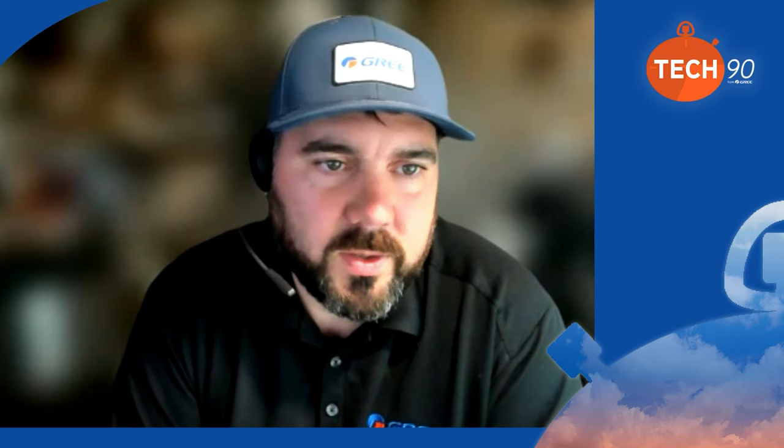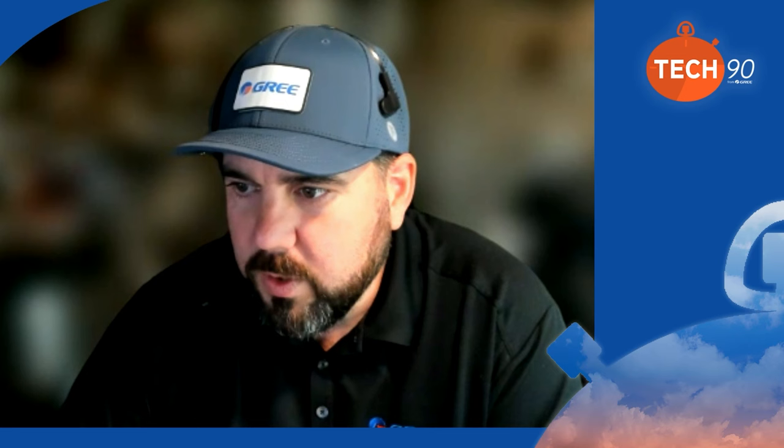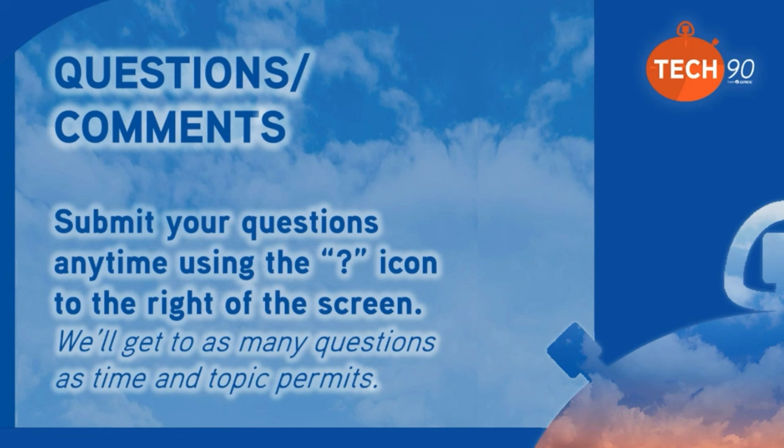And the next question, Drew's asking, for the air handler unit, what's the max size filter and MERV you can run on these? He was told only run a MERV 8 1-inch filter. What do you think, Greg? Well, yeah, a 1-inch filter. If you're talking about using the filter within the air handler itself, I don't really like to talk about MERV rating so much. I talk about the static pressure drop across the filter.